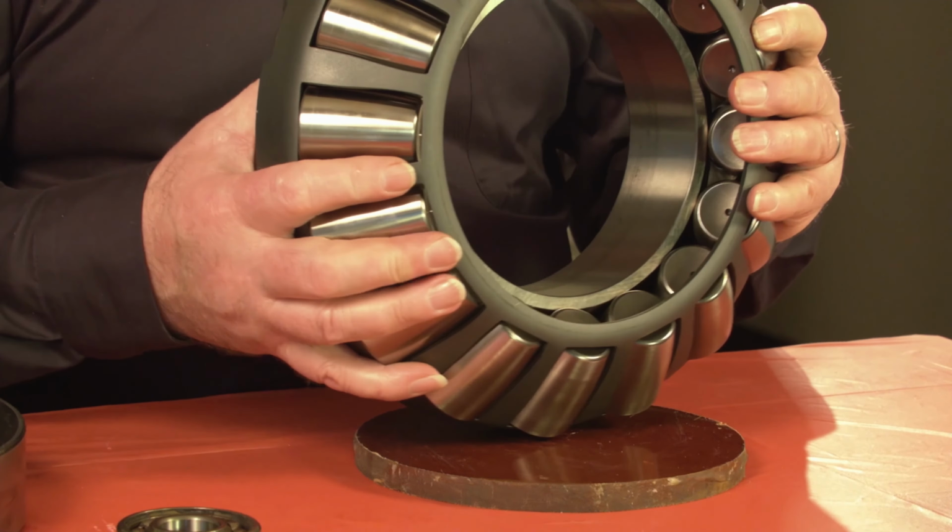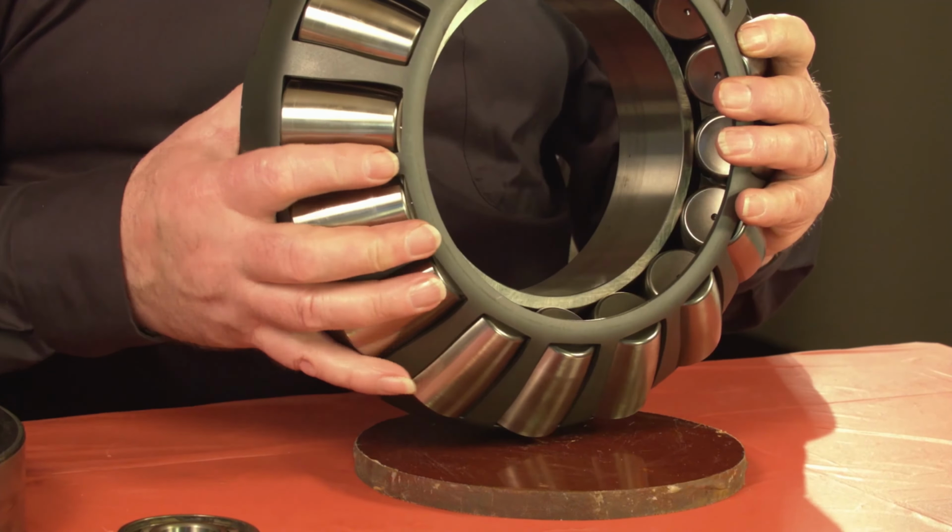Spherical roller thrust bearings, running at the speed ranges produced by electric motors, require compression springs to maintain a minimum preloading of this type bearing. This spring preloading prevents smearing damage between the bearing roller and its raceways.